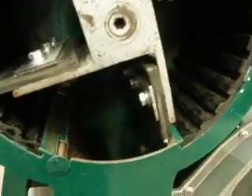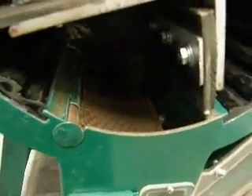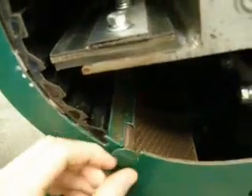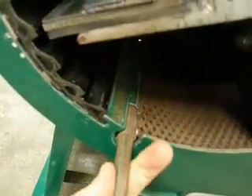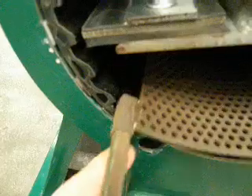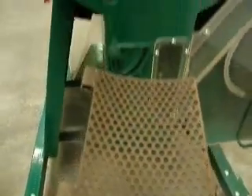The threshing chamber also consists of an adjustable, easily exchangeable screen which ensures your seed is threshed to the required standard prior to being separated. The screens are easily removed by lowering the screen to be fully opened and removing the square pin as shown. Upon removing the screen it can be easily replaced in a matter of seconds, reducing downtime when selecting your screens. The screens are constructed of mild steel and are designed to last.